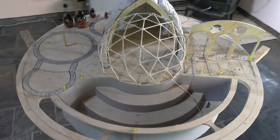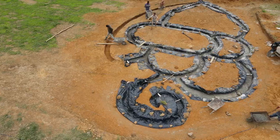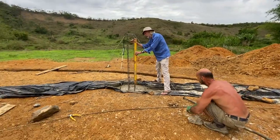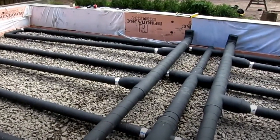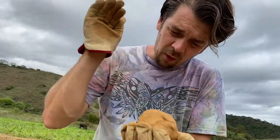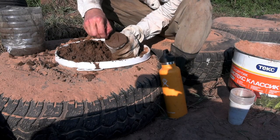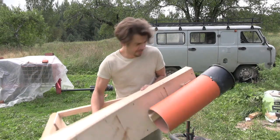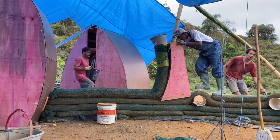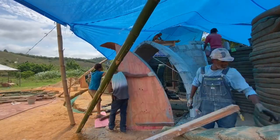To explain the construction of the foundation I will teach using my Brazilian build, my Siberian build, as well as the one on my own land in cold climate. In the theory class I will explain the necessary alterations required for various soil types, water table levels, and climatic conditions — for example, waterproofing to avoid wicking of moisture up the walls, and insulation to stop frozen clay from lifting up your home. You will also learn how to do a simple soil test to get the right mixture for hyperadobe.